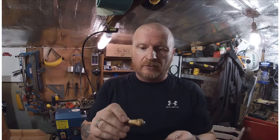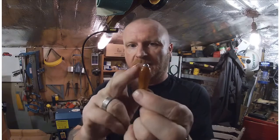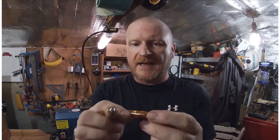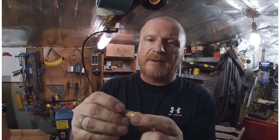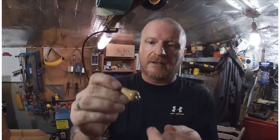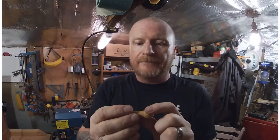Well, that's it. That's today's video done. Beautiful, stunning. The finish on that, like I told you before we started, they will be very similar. No polish or anything on this. Literally just used the micro pads to sand that back to a gloss finish, and then this with super glue or CA finish, and again just sanded back with the same micro pads from Axminster to come up with the same finish. Is a beautiful finish. That will be quite a hardy finish, especially for a light pull from the greasy oils from our hands. Yes, that should last quite well.